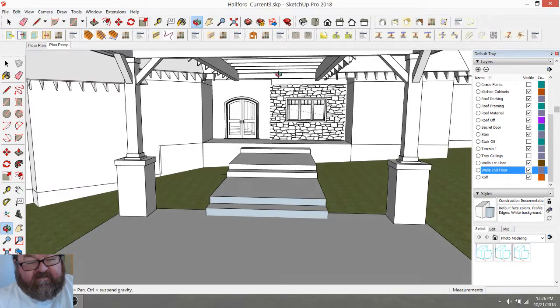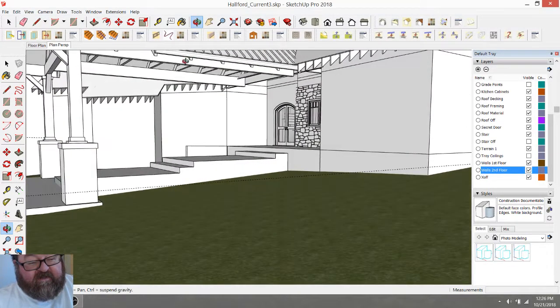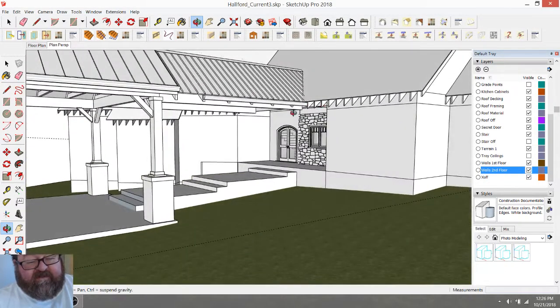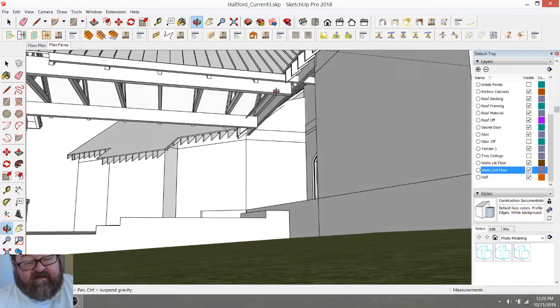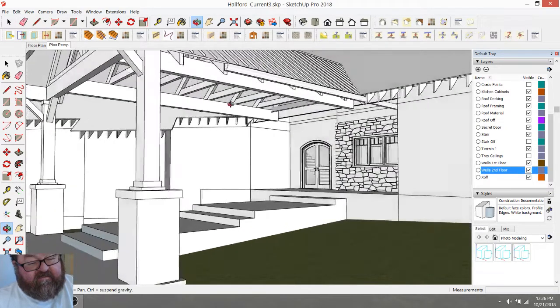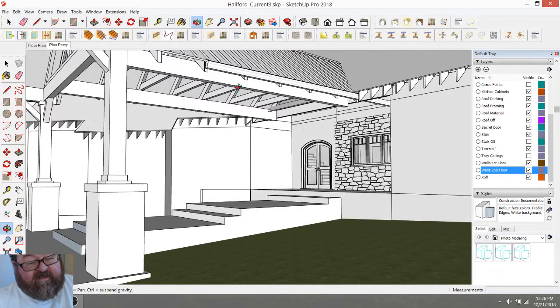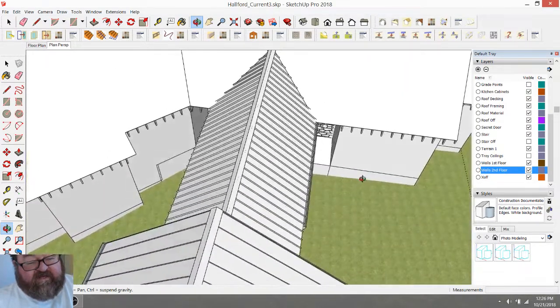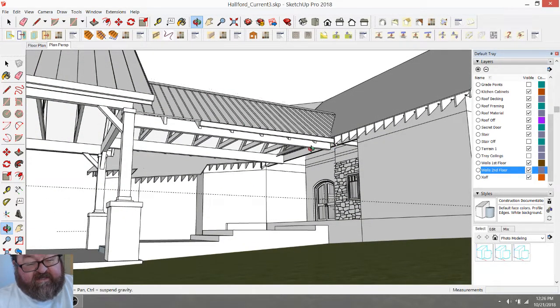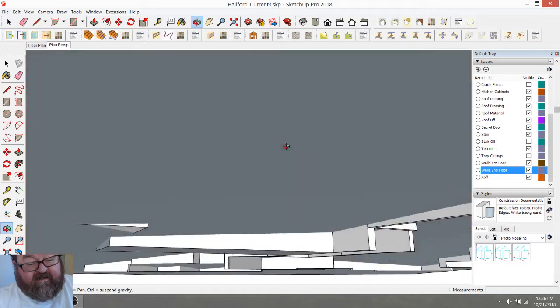You could hang these beams, this little connector piece, off of this beam. You could size this porch beam going across here with maybe 3 or 4 LVLs, and then hang this. I was kind of envisioning this as a timber beam, maybe a big 6x12 or something, because it's not going to be carrying that much weight, just that little connector. Maybe put some metal brackets on either side of it, kind of cool, black, you know, heavy.